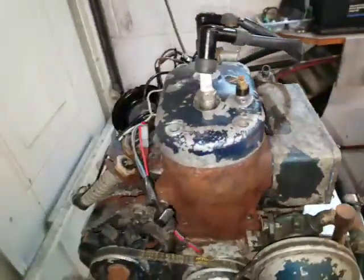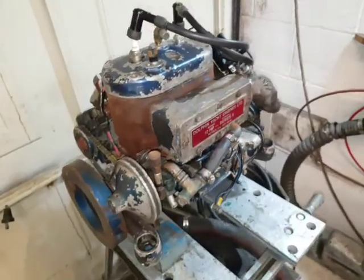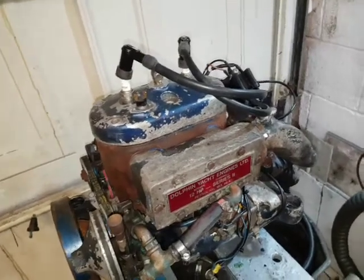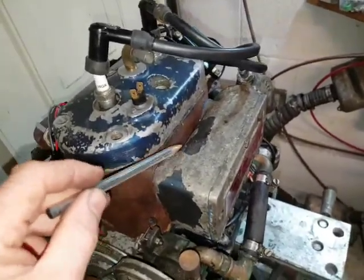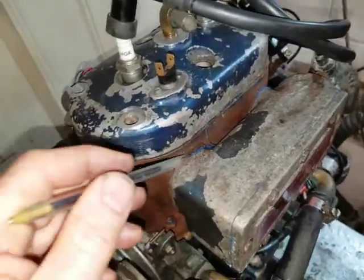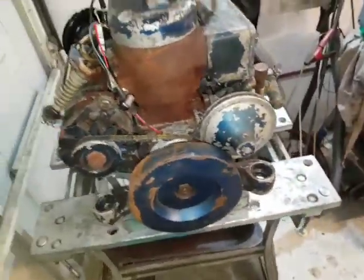So probably you'd have to change the gasket every 2 years to keep that reliable. I don't know. There's an awful lot of work to rebuild this because of all of the joints and faces, and there's so many aluminium parts. Once they're disassembled, I'd want to clean them up immaculately inside, not just outside. And putting some kind of paint finish on these bits that's going to last is nearly impossible, because it's getting hot, you've got salt water everywhere, and there's junctions with dissimilar metal. So I don't think it's going to be easy to find one which hasn't got the paint flaked off like this one, but that's the way I like to do things.